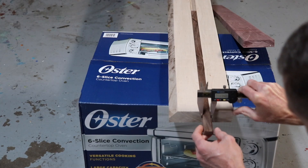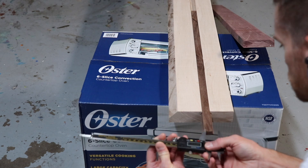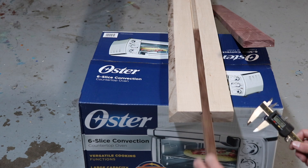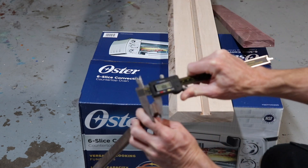Back to the build. I made my inlays 1 inch wide at the base, 3 quarter inch wide at the top, and 3/8 of an inch deep.